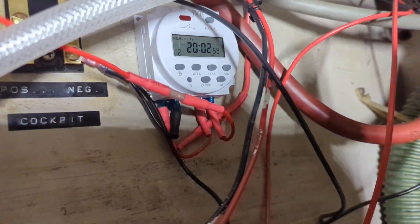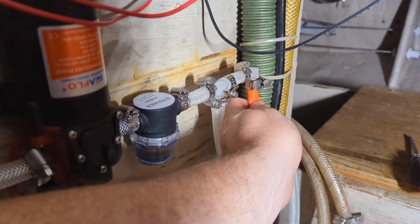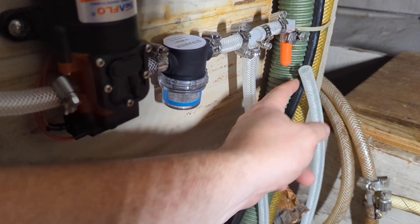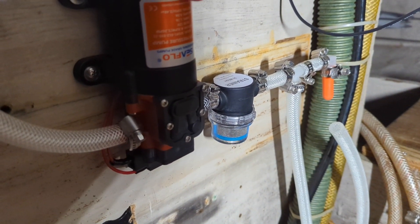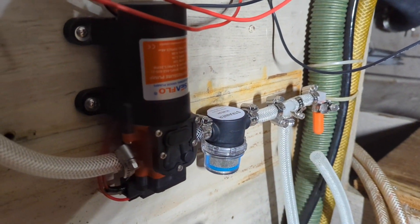The timer is set up and it's getting late. I'm going to leave this with the second pickup capped off. The main one goes to the main bilge, which collects more water, so I'm happy it's working on that one. The one under the engine doesn't collect as much water. I might come back and add a second pump and strainer just for that one. But hey — trials and tribulations of boat ownership. Calling this one done. Heck yeah.